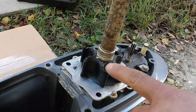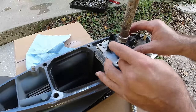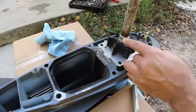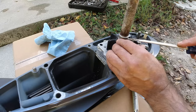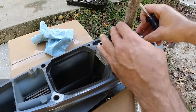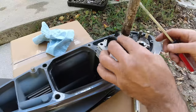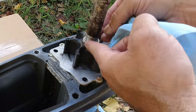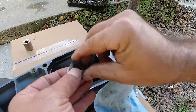Wow, it really has some damage — look at all the scoring here, so it's losing some pressure. The way we're going to install the impeller has to be the same way as this one — it can't be the other way around. Now I'm going to remove this stainless steel part here. There's a little plastic piece with a little opening — just remove it, it should come out fairly easily. Here there are three washers: two flat ones and one wavy. The wavy one goes right in the middle.